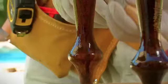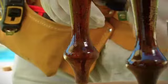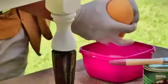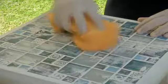Now that our tile adhesive has completely cured, we're moving on to grouting — putting grout into each of the grooves between the tiles to ensure a smooth, flat surface. Because it's a 3-in-1, it will adhere, grout, and also protect and seal the top of our table so water or moisture won't cause damage. While that's drying, we'll apply two coats of varnish to our legs to protect and revive the wood. A varnish or wood preservative is a good option — two coats ensure proper coverage and keep the wood looking great for longer. Using a damp sponge, simply wash off the excess grouting to reveal the newly tiled table top.